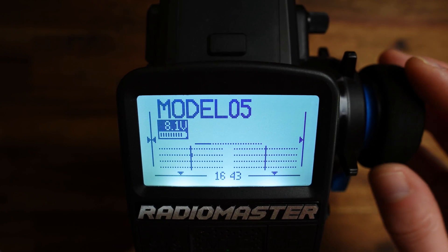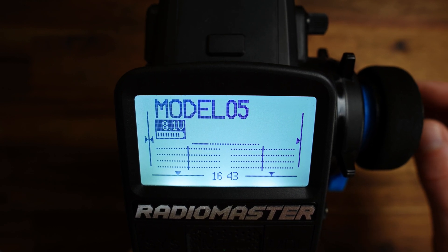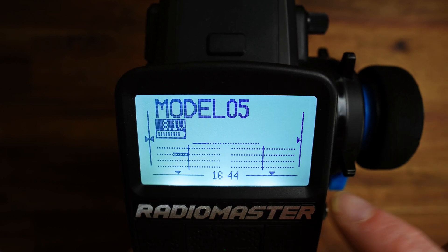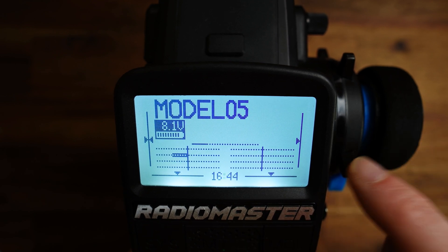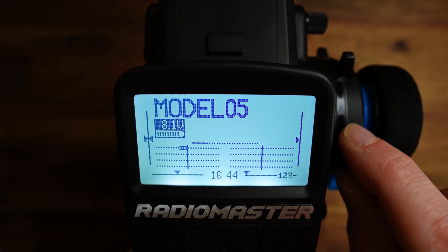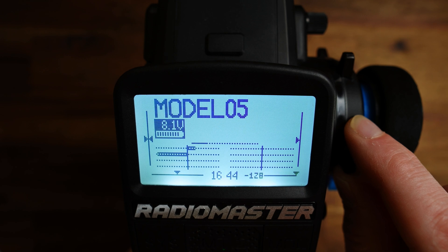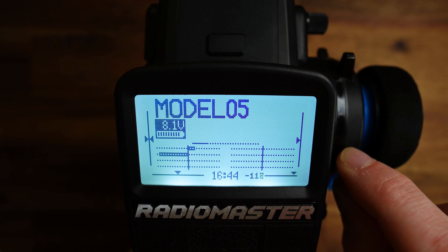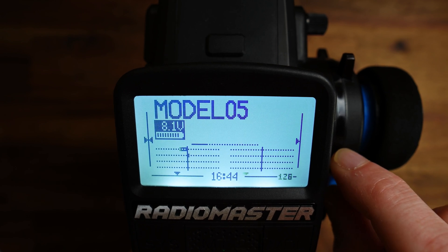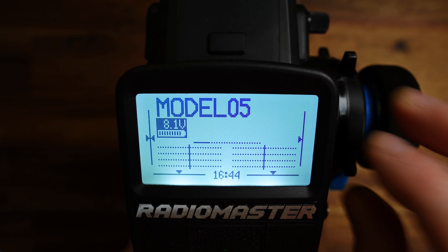Let's check the monitor. I pull the trigger — everything normal. If I push the trigger, I have only 50% deflection, because T1 is in the middle. If I use T1 in one direction, the deflection on the brake side is reduced. In the other direction, the deflection is increased. However, we can see we are also changing the trim for the steering channel with T1, and this is what we are going to change now.